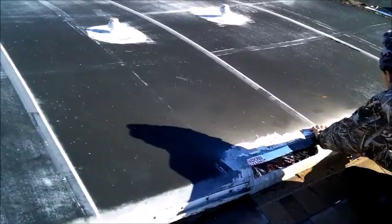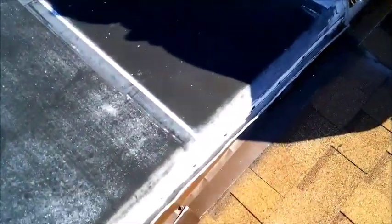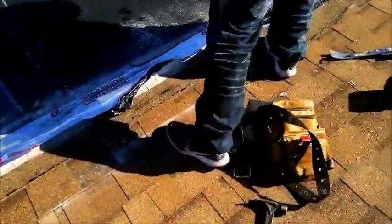This rubber roof has TPO rubber on it. Every 5 or 6 feet, there's a seam, and it's a heat welded seam. You can tell it's very small. And this is what's happening. Been going on for quite some time. They've been fighting a leak.